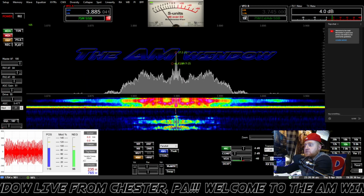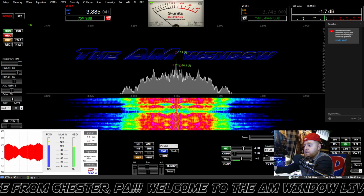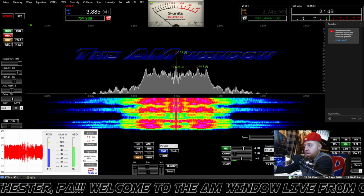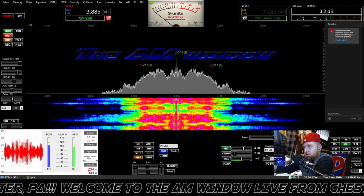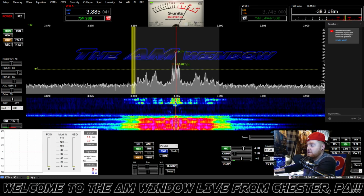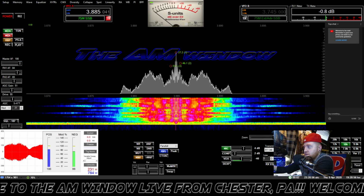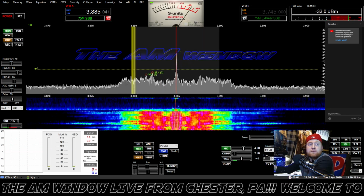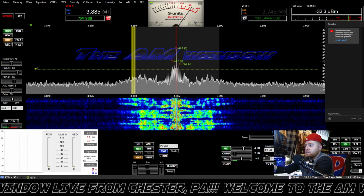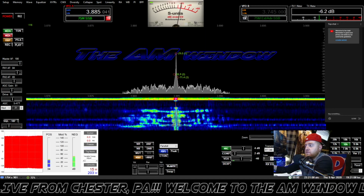I just assume move to 75 if you guys want to. It don't matter to me. But if you don't want to get up and change stuff, it's understandable. I could just notch them out. Set up like 100 little notch filters for all the little Heterodynes. Yeah, they're piss weak, and everybody's pretty much zero beated on them, so it's not really causing any issues. And when anybody keys up, if you're relatively close to them, zero beat, they just go away.